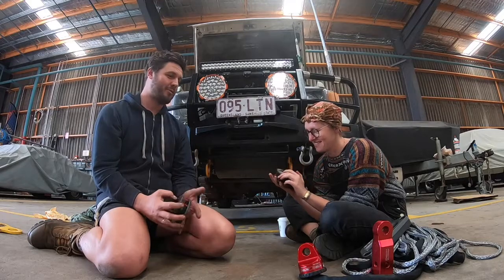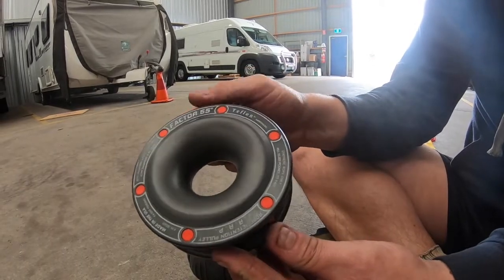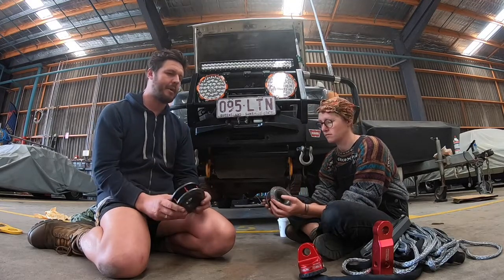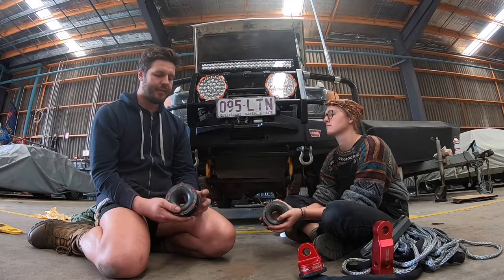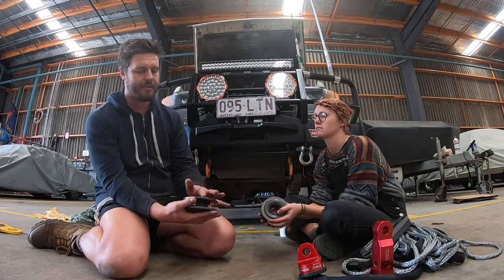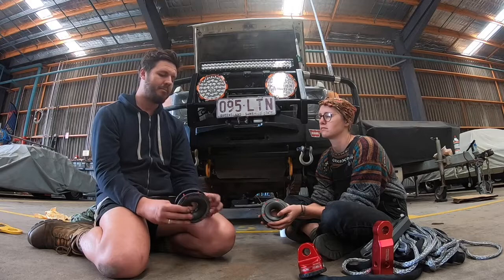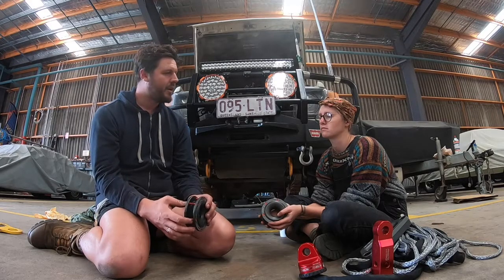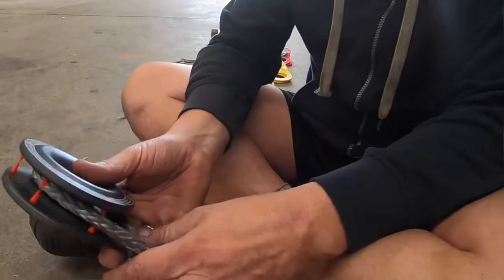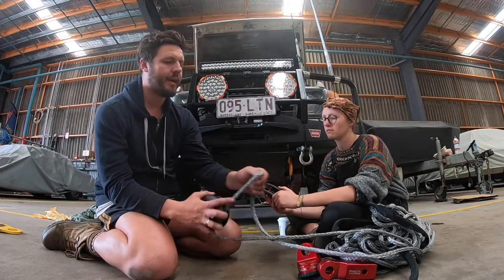I love their gear. I think it's really good. I love what they're doing as far as changing the way we look at winching. There are many other companies that make pulley blocks like this, but Factor 55 has a few little things — this radius here and this lip, where it sits up so the rope doesn't run on the flange but across there. And probably more than anything, this silicon retainer here — just a little touch, but if you get a momentary slack in your rope, it doesn't pop out. To my knowledge, no other company is doing that.